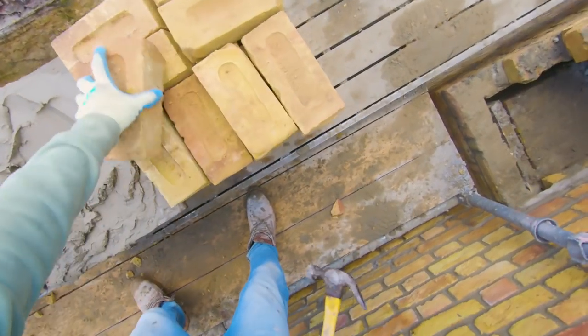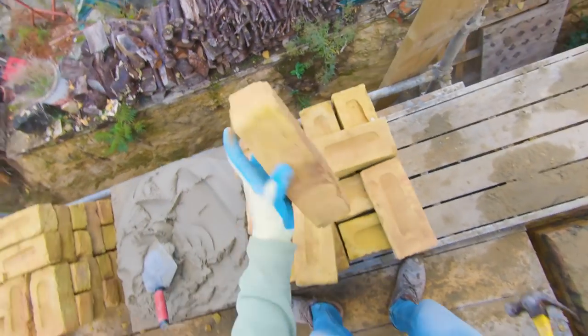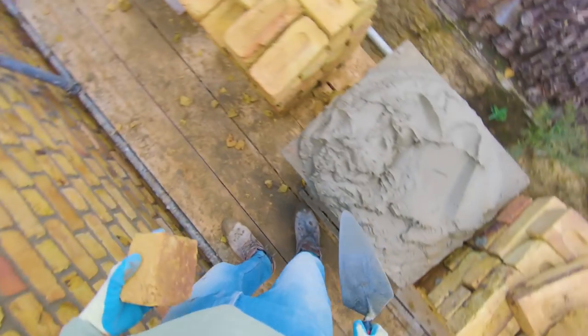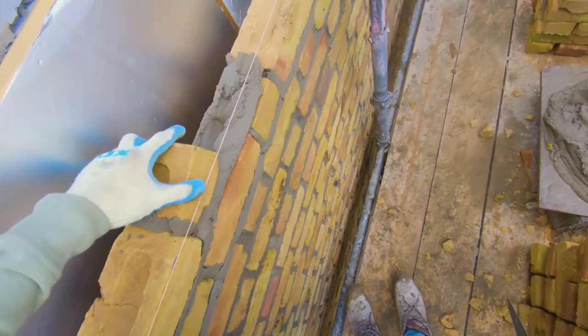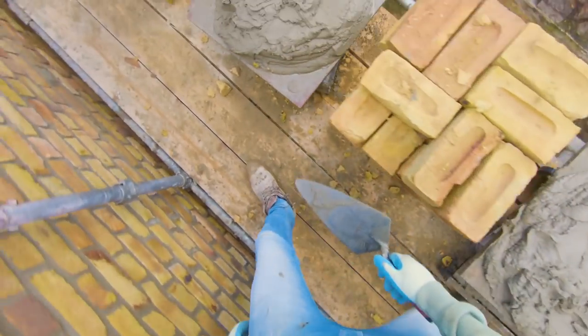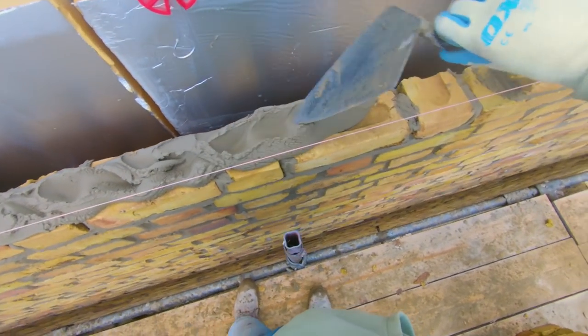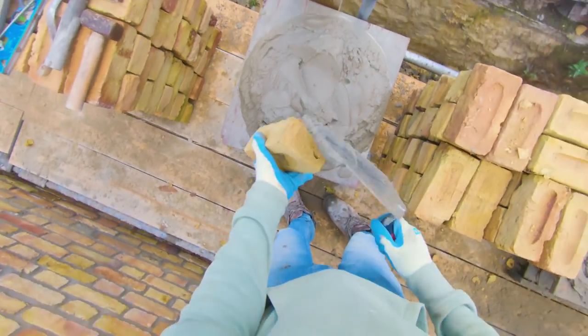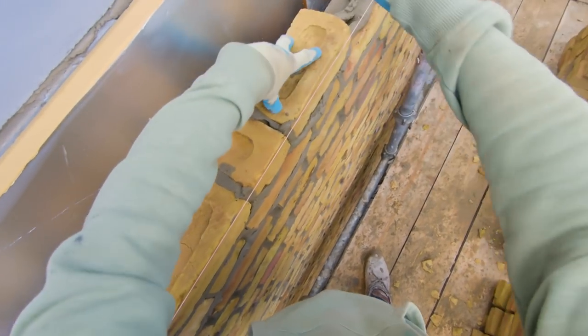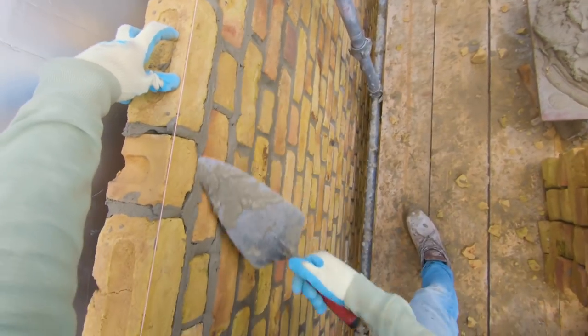Another one in — snapped it in half. I do it with the trowel to save time; by the time I walked over to pick up the scutch I'd already snapped it with the trowel. Scrape, shave, save. Look on the back for snots — not bad. Move to the next board, clean all the crap off that I've been flicking in. Nice bit of gear, get it in there. Look at that — that's back in nicely. A bit too much in there, just scuff the middle off. Also I like to put bricks down in a particular way: I put the top in and then drag it in whilst applying pressure so you get a nice full joint in the perp.